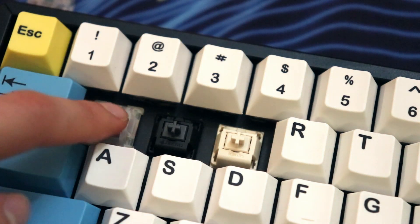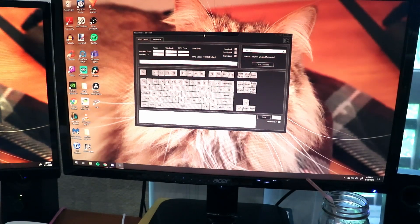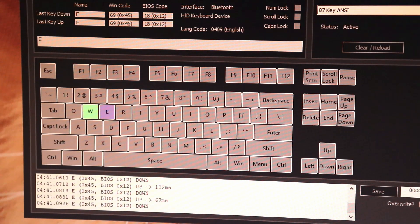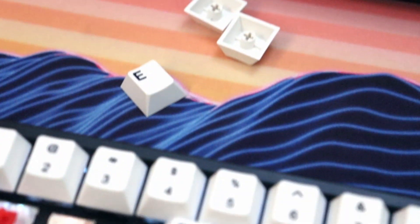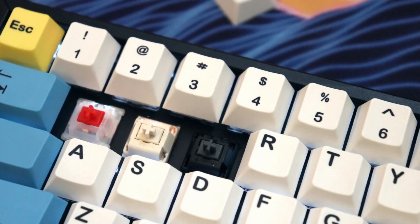Number five: you want to test all your switches directly after putting them all in. You can use an online keyboard tester — I'll put a link down below — or you can download a program called Switch Hitter, which allows you to see if your switches are registering with your PC or not. If a switch isn't registering, take it out and check for a bent pin because that's usually the cause. If there's nothing wrong with the pins and the computer still isn't registering it, it may be a problem with the hot swap socket itself, which is a more serious issue that involves desoldering your hot swap sockets and putting on new ones.